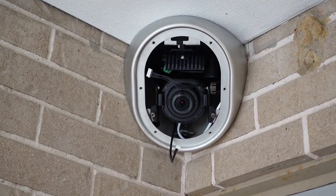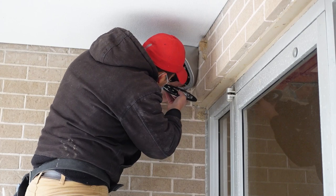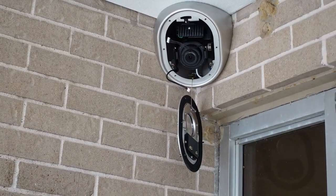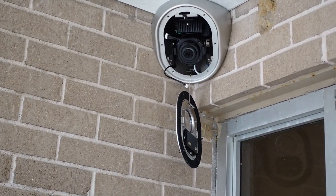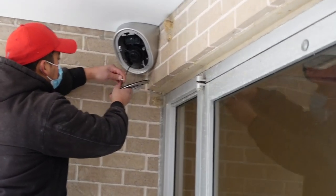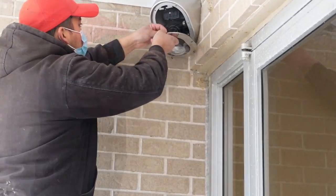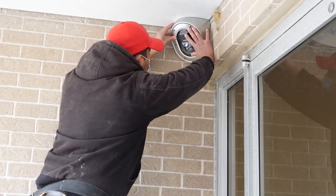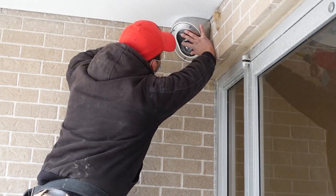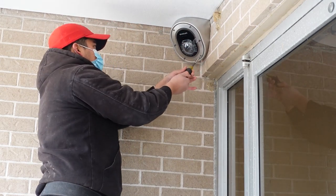You'd first get started with your fingers and then tighten them with the screwdriver. This is a shot of the camera installed. He's going to attach the lanyard that connects to the front cover. As he installs the cover plate, he's going to attach the wire leads for the microphone and the infrared illuminator, and then tighten it down with a security bit for the security screws. That's the physical installation of the camera.